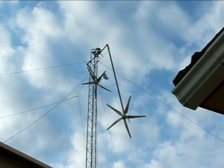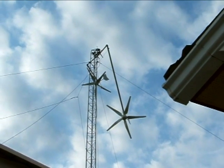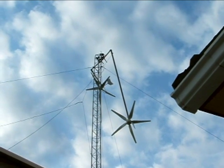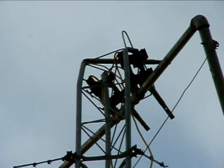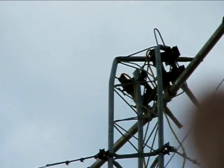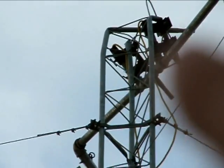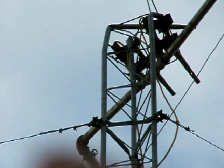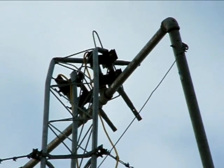Ouch — not good. Too much torque from the generators buckled the tower on the top. I'll post the camera so I can refocus and zoom in closer so you can see why that happened. At the point that it buckled, the clamps where that tube is held on — the bottom pipes are not sufficiently long to distribute the load over those cross members on the tower, and so it buckled.